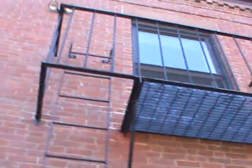Cement looks good into the building. So I would recommend sealing those so that the water doesn't get back in there. And the fire escape is in need of a paint job, and this one can get away with a spot paint to make it pass. The other fire escape, same thing. There's still enough paint on this fire escape that you can spot paint all the rusty spots, and she's looking good.